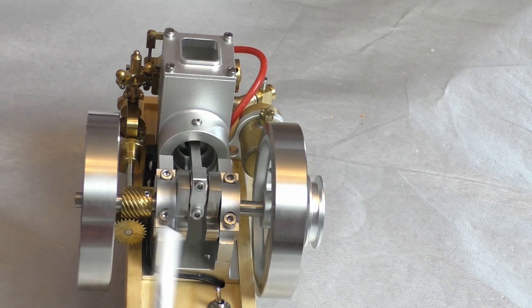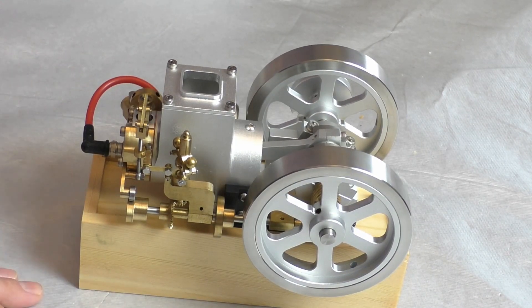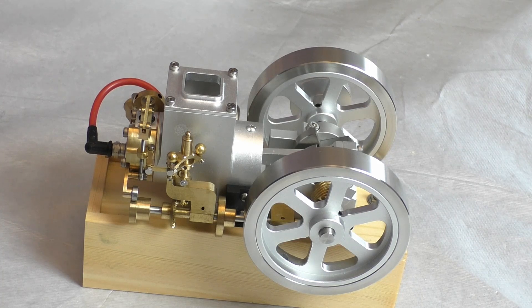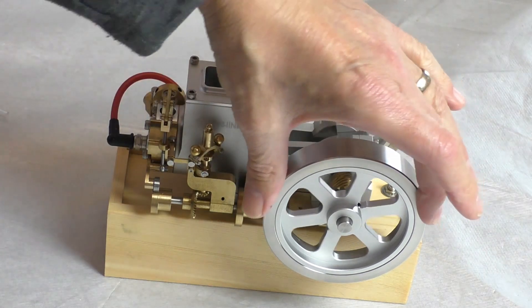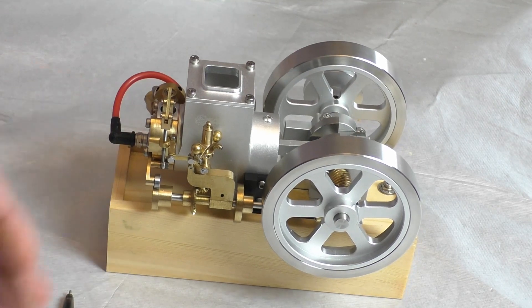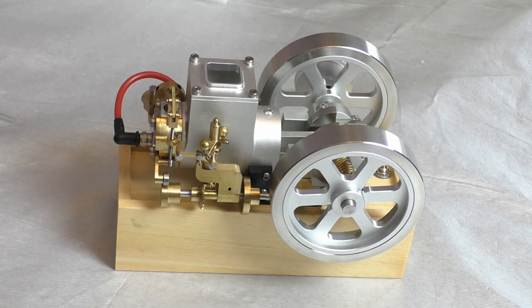If you imagine having this in a mill with all this open gearing, you'd get a lot of dust and wear, leading to breakdowns and repairs. Eventually the four-stroke petrol engine was just more reliable. It's also lighter — to keep a hit-and-miss engine running at a consistent speed you need very large, heavy flywheels. A typical six-horsepower hit-and-miss engine probably weighed 400 to 500 kilograms. They're also slow-running machines, typically up to a maximum of about 250 RPM, averaging around 150 RPM on load, whereas a comparable four-stroke petrol engine might run at 500 to 750 RPM, giving more power.